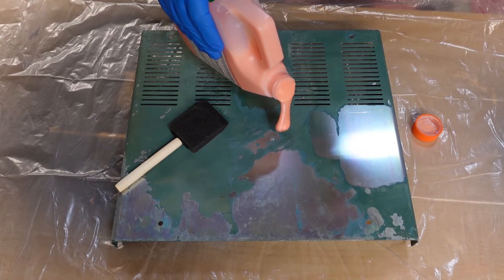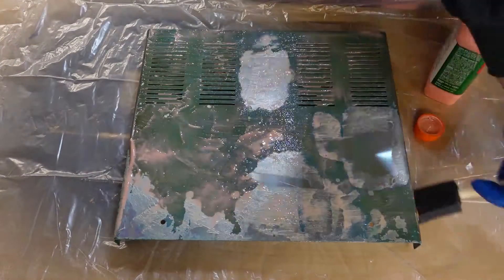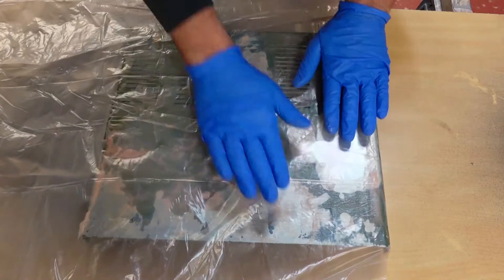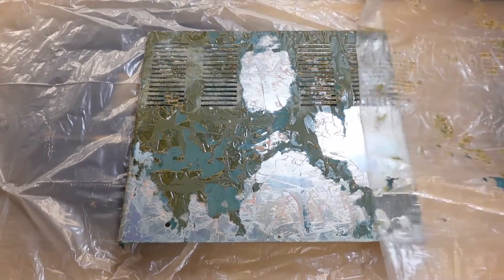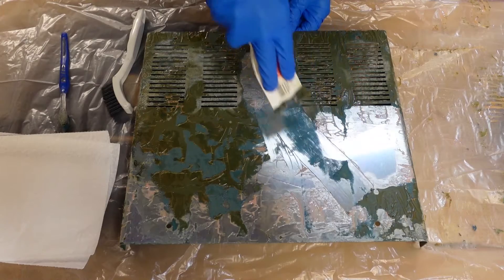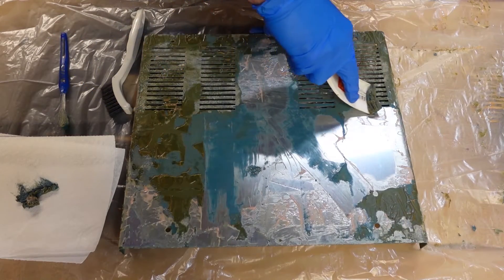With that decision made, it's time to get busy. The stripper has the consistency of mayonnaise, so it's easy to apply exactly where you want it and it does stay in place. It does have a pleasant citrus smell. I'm doing this step with all windows open, and even though it says it doesn't need to be wrapped in plastic, I'm doing it anyway because the air is very dry. I let it set for 24 hours. Look at how well it softened the paint — a lot of it is stuck to the plastic. The chemicals in the stripper also reawoke the smoke stench in the paint. But the upside is the bare aluminum certainly won't retain that odor, so it'll be gone forever.